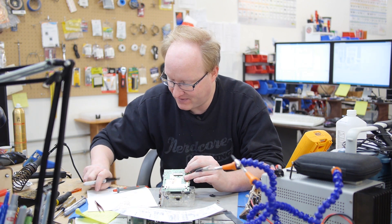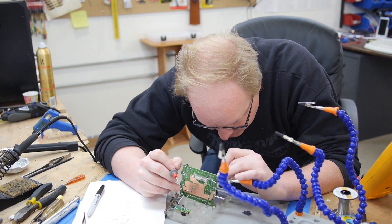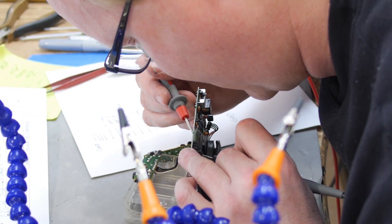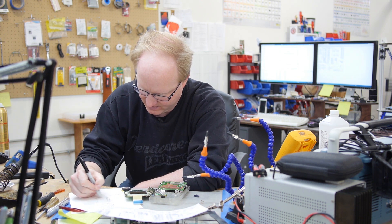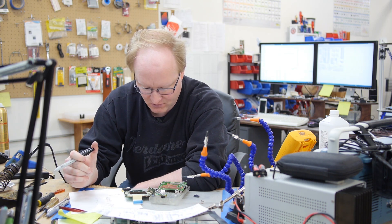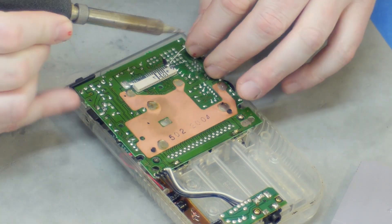I just have to go through and map all six of these. It's a little trickier because I have to touch these pins on one side and then on the other. So we have two grounds, our image data, and our controllers — that should be everything we need to hook up the Game Boy. Now I'm going to remove this connector and attach my own.